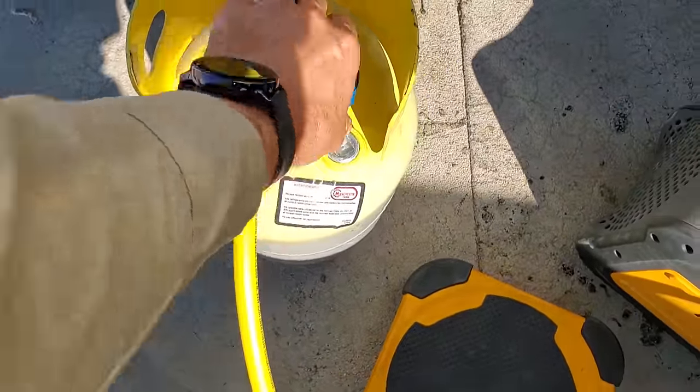So they wanted to get rid of that smart hood system and go to conventional motor starters to protect the three-phase motors, which is fine. It still protects the motors, but here's the problem. They had me do that and I did it. But when I did the hood bypass for them, I had to rewire the whole hood system, make sure that it was tied into the fire suppression system, make sure that it was tied into the fire alarm, make sure that when they turned on the hoods, it put all the air conditioners into occupied mode. It was actually a rather intricate process of doing this and programming it and setting it up the way that it needed to work, but it created an issue.